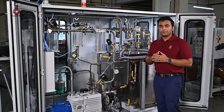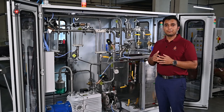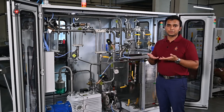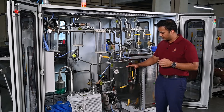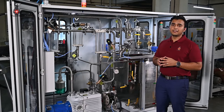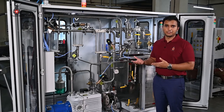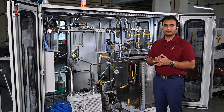The third important part of the storage and transfer assembly is the agitator. The agitator makes sure that this mixture is continuously mixed and not kept still, because the coolant would settle at the bottom and water would rise to the top. We also have the standard gauges here — the level gauge, the fill level gauge, the high level point — and a four-point level transmitter coupled to the PLC that provides input of low level, high level, or even a dangerously high level, so that if any parts of the machine are in an error condition the operator can take the correct actions.